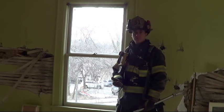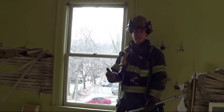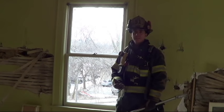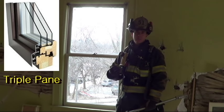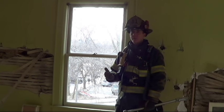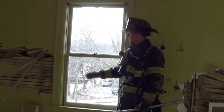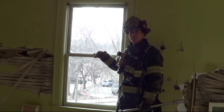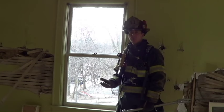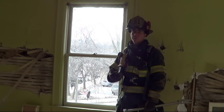When we look at construction first — for example, if you're dealing with a single lightweight glass pane window, something you can find in an older home, those are going to be a lot easier to take out than if you're presented with a double or triple thermal pane. We could also have storm windows and screens that have to be cleared. And finally, you've got to take into account what the framework is constructed of — we could have plastic or vinyl windows, wood, or metal, which in some cases can be quite formidable.